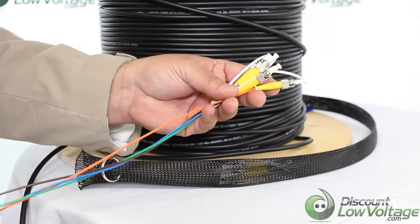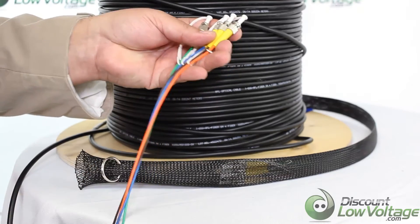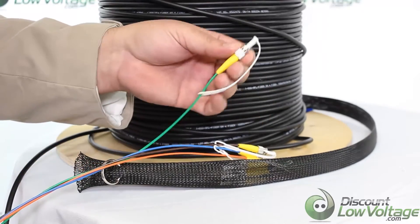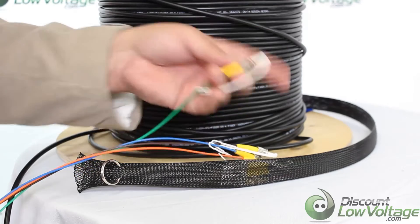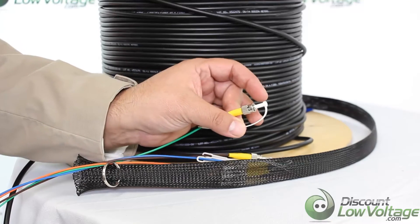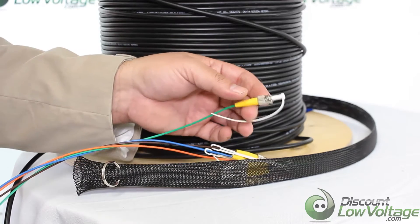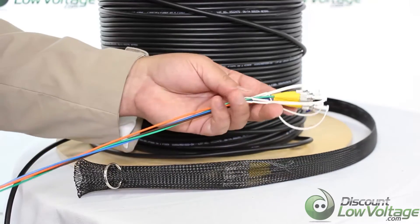The connectors are all even — we don't stagger them — and they're colored differently so you can identify which strand is which on the other side. We also have caps attached to the tube so you can unplug and replug them when you're done. You don't want to lose these caps; fiber connectors are pretty sensitive to dirt and a speck of dirt in the way could cause you big issues out in the field.